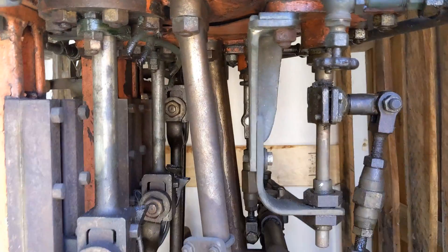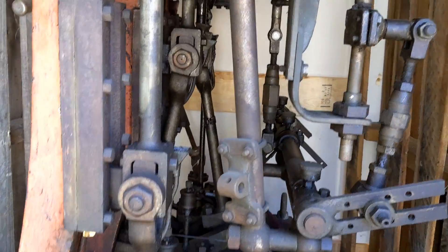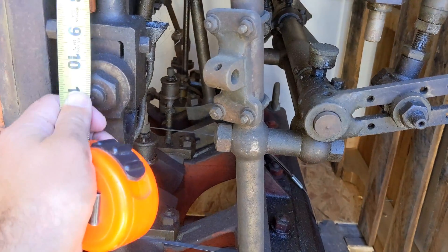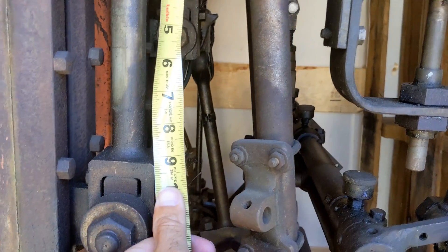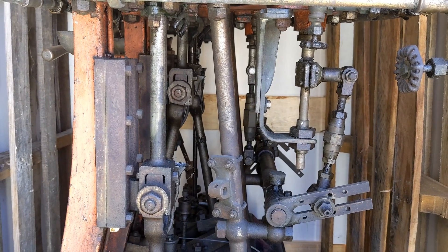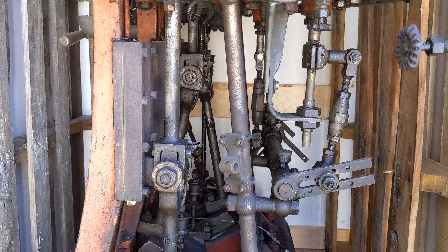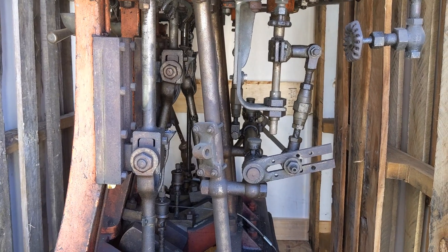I can turn it over and see if I can get a full measurement. Good sign — it turns over pretty easily, at least those last 60 degrees to get it to bottom dead center on the low pressure. Measuring from the packing gland down to the witness mark on the piston rod, it actually looks like seven and a half inch stroke. It'll be interesting to measure the bores and do calculations through the plan formula — I'll put that on the screen. We'll try to figure out the indicated horsepower of this engine and go from there.